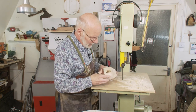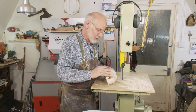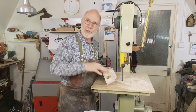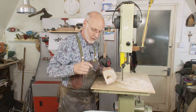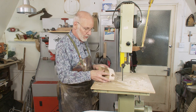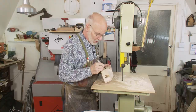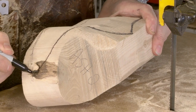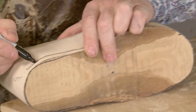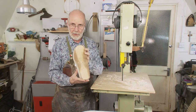You'll notice that inside the wood was a bit of a flaw. I can fill that with car body filler, because sometimes when working with natural tree, there's a branch in the tree, the tree grows over it, and it's not until you cut it that you find it's there. But that's not a problem at all. I've marked on the profile — I'll go over it with a Sharpie, just so you can see what we're going to be cutting out. And you see where I projected it down, it takes that shape. So we've got the outline. Now I'm going to do the profile.